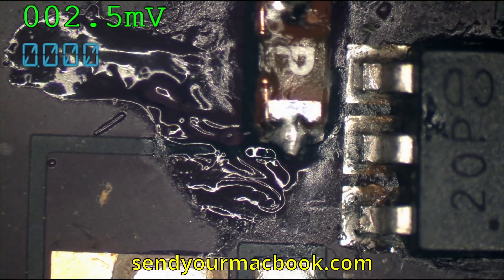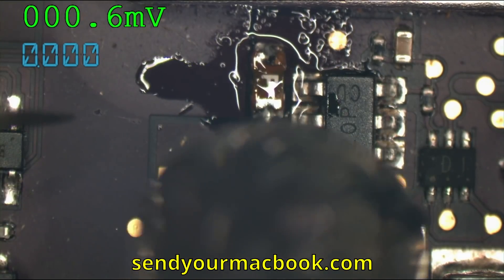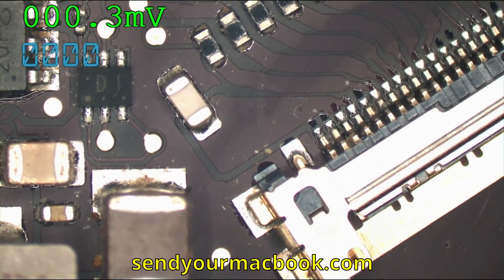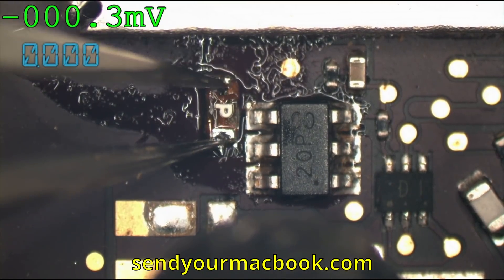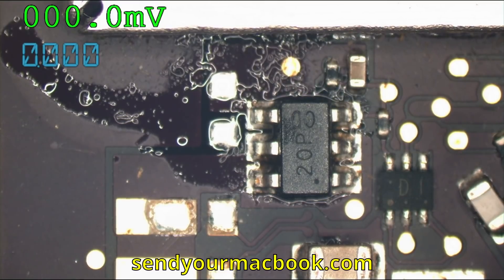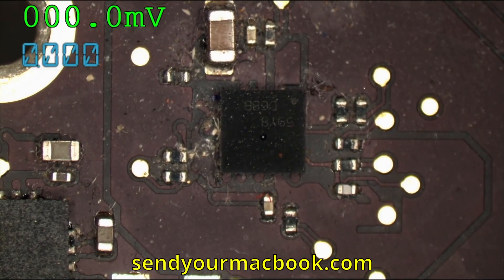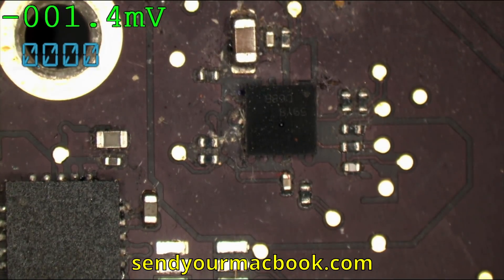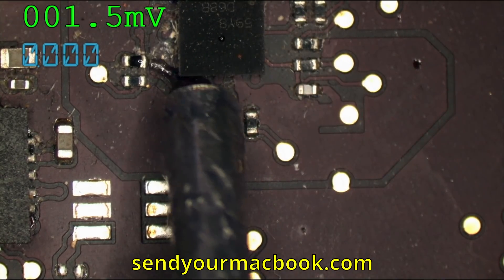Some fume extraction. With this one I want to keep my hot air away from the Wi-Fi card and the connector, and I don't really want to overheat the LCD connector either. This can take some heat, so I'm just aiming towards the can to get the fuse out of here. Before I change that fuse, let's go look at the backlight driver. The backlight driver is directly on the other side of the board, and that looks like it has some junk underneath one side. Backlight drivers are easy — we get them new, they go all the time. Even with just a little bit of junk like that, let's get this thing off the board. This is probably the reason, though it could be the screen.